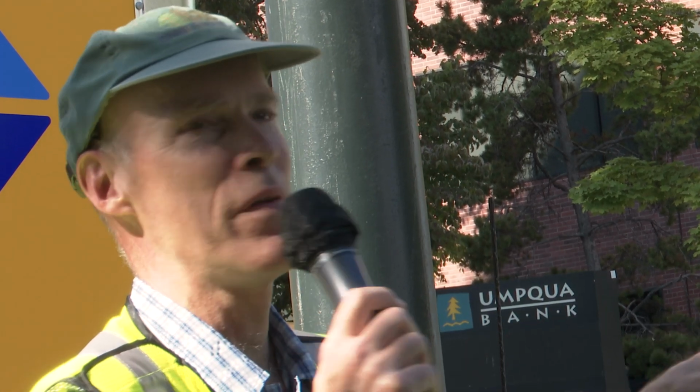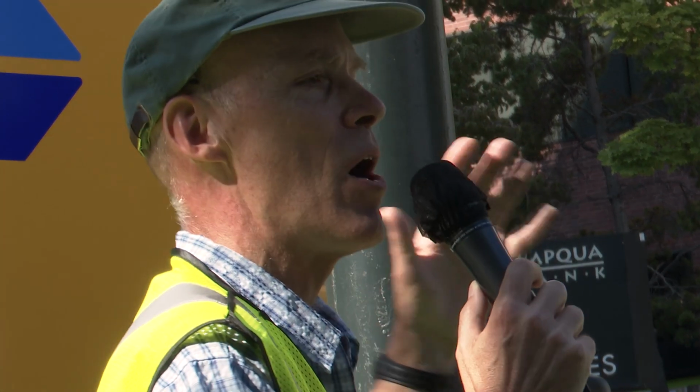Yeah, so maintenance interval is everything, and I forgot to say, and I think this is true for all jurisdictions we've ever talked to, once a year is the maximum we can do it. And that'll be a real standard for this. If this thing clogs in November after cleaning it in the summer, that's trouble for us. So we're looking for a 1-year interval, and again, as these units have gotten smaller and smaller, that's the big question mark for local jurisdictions. I haven't found any jurisdictions that are willing to maintain these kinds of systems more than once a year.